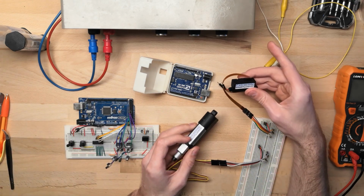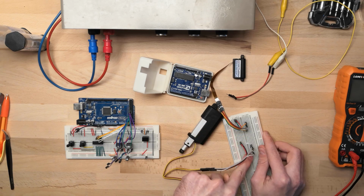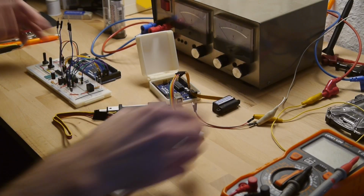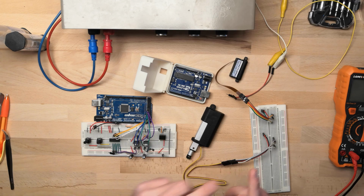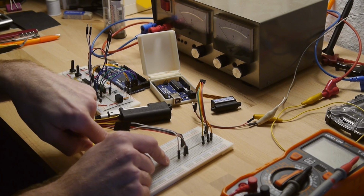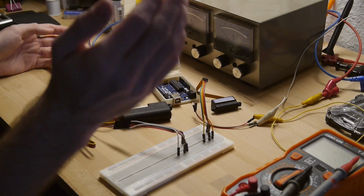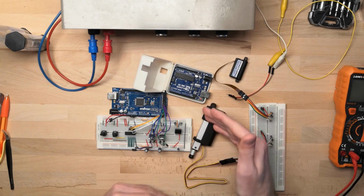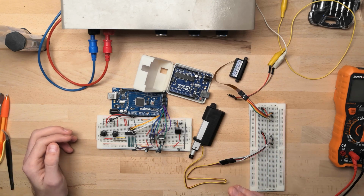These two are the PQ12 and the P16 linear servos. They both have a power input on this side, and they both have 3 cables output for the potentiometer built into the linear servos, with which we will measure how far the linear servo is extended. So what we will have to do is first replug all the cables to the Uno, take these cables, put them into the power input, and then we have to reconfigure this part over here with the 2 potentiometers, so it will run with the potentiometers inside of the servo. And then we will jump back to the code on the computer for a second to see how we will rewrite the code so we safely run the linear servos. Because unlike LEDs, these can run, well, only so much. An LED can run forever until it's burned out. These ones have only 5 centimeters, so we have to look after that in the code.